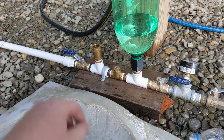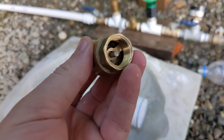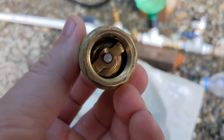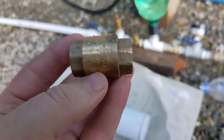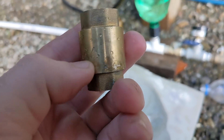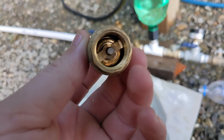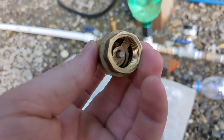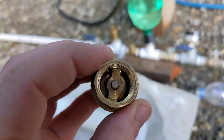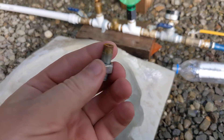So a linear slide valve like that — I have actually modified the core. Here's one of those valves; it's spring-loaded, you can see a spring in there. You can actually disassemble these — there's a split line in there — and take it apart. I removed the spring and took the core out and tapped the end of it in my lathe with a 4-40 thread tap.